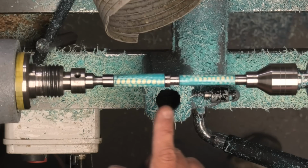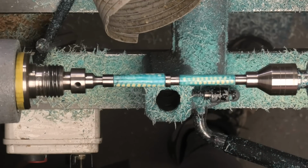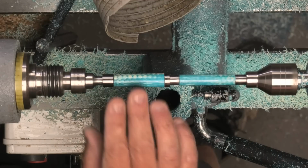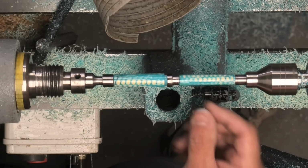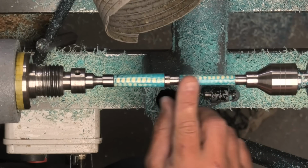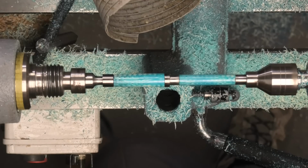If you do get that build up, that very, very thick area, the only way to sort that out would be to take it back, sand it back again. And you can do that periodically if you wanted to. If you got a little bit of ridginess, I'll get a little bit of ridge there. If you got a bit too much ridginess, then you can just do a little bit of light sanding and start again. It's not an issue. It'll cover it up quite nicely.